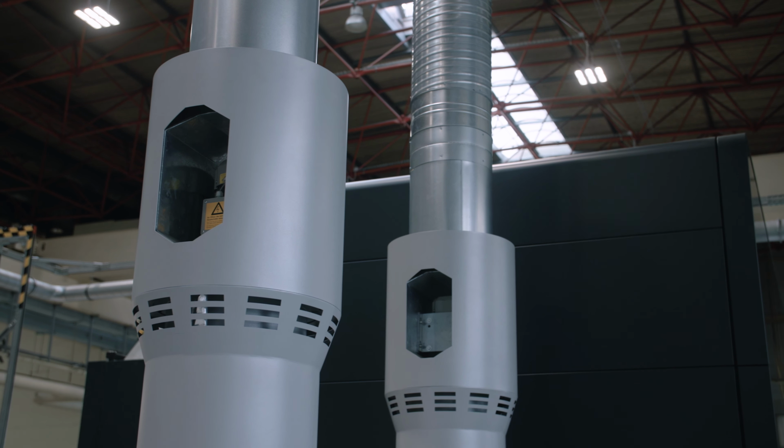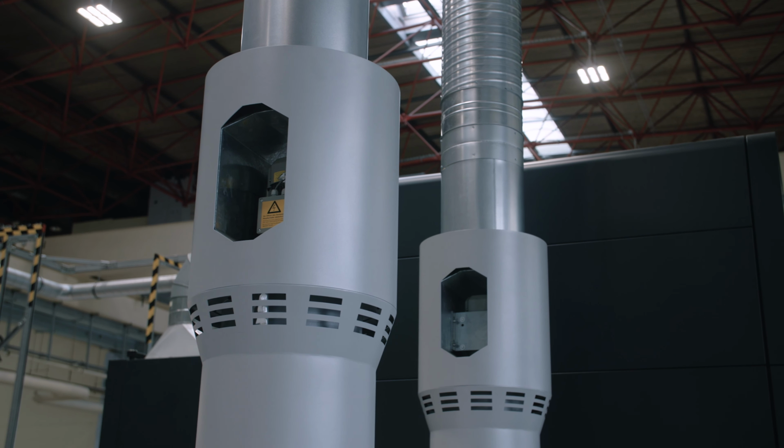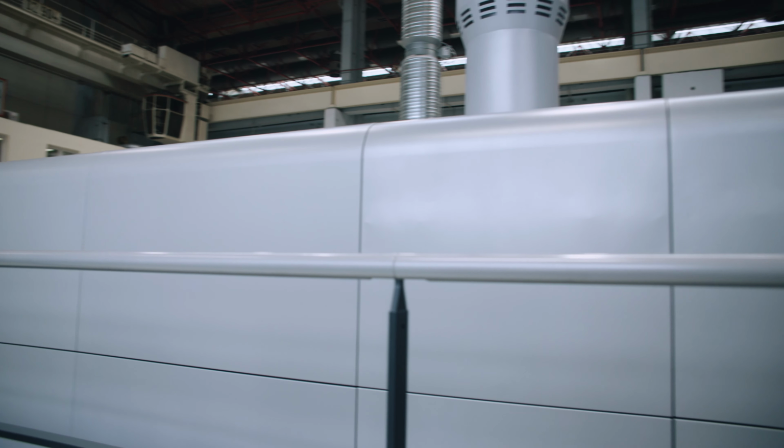And here we've got, again, hot air and infrared technology from the Rapida 106, market-proven technology, to dry the sheet. Roughly the first half of this dryer is to dry the sheet, and the other half of the dryer is to cool the sheet a little bit down, to give it time to relax, because we want to process the sheet within the print run, immediately after printing. And so we decided to install a chilling unit, a cooling unit, so that we can apply coating, for example, on top of it.